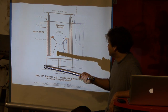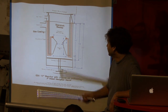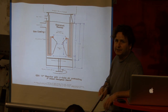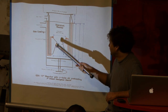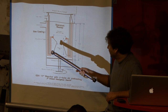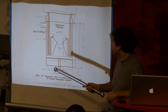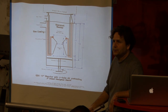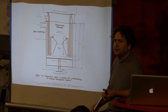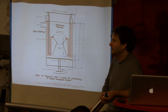Other than that, these basic shapes in here represent all the same battles that Imbert was fighting back in the day. It's still, in this form, passive pyrolysis and passive drying. We're still working out the same four processes — we're getting a combustion zone starting up here, the combustion propagates until we run out of oxygen, we have reduction here, and the produced gas of CO and hydrogen goes off. We pass the pyrolysis zone up here and the drying at the top. Those are the four processes of gasification — those are what, when you look at a textbook explanation of how gasification works, are called out and shown how they combine and recombine into different gasifier configurations.